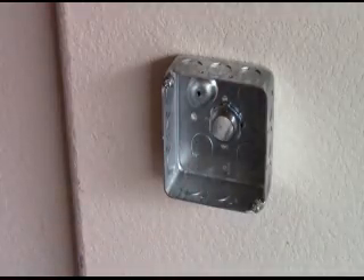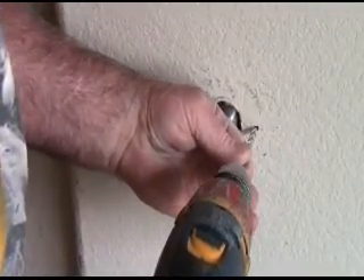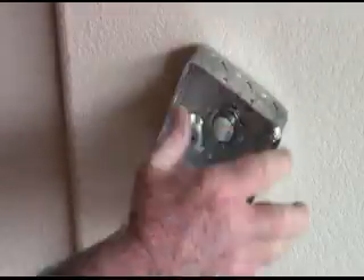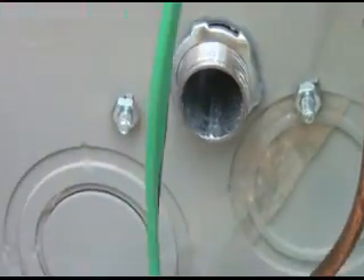This nipple alone is a good anchor but we're going to anchor it with two more bolts and then drill all the way through the panel. Line up those screws. The screws are in on this side and they're threaded all the way through on this side. This is a plastic bushing that keeps chafing from the wires hitting the metal, and we're going to put the same kind of bushing on this side.